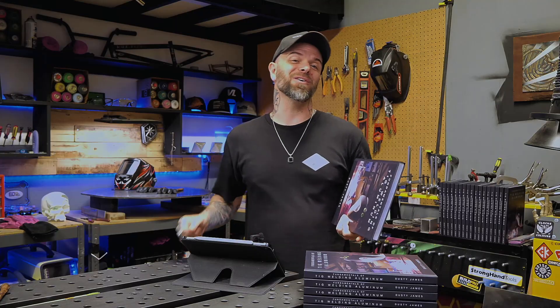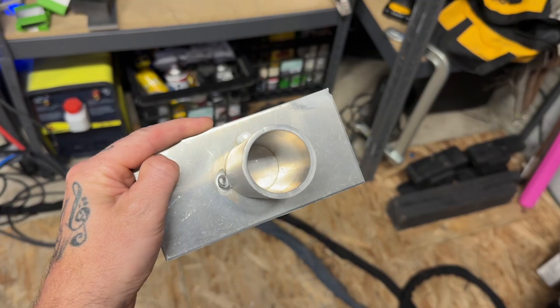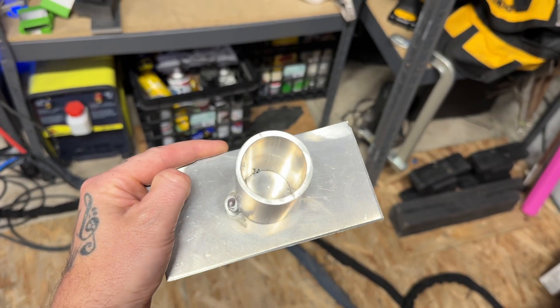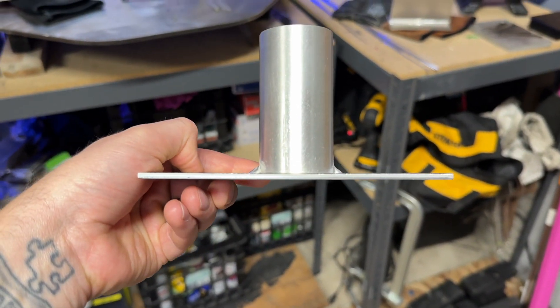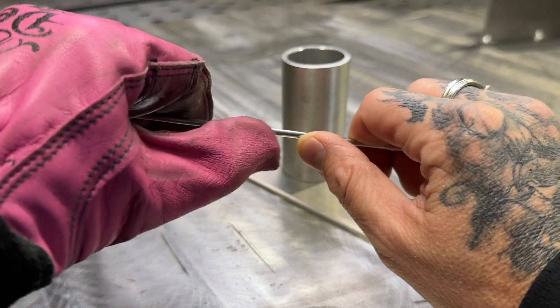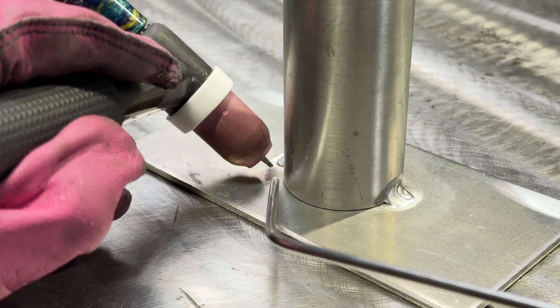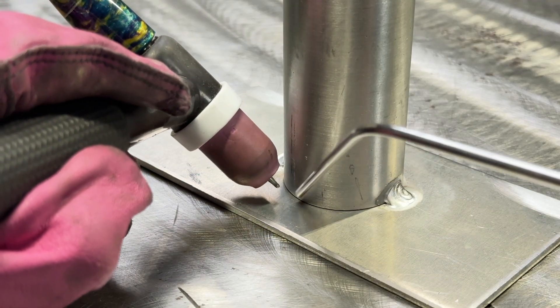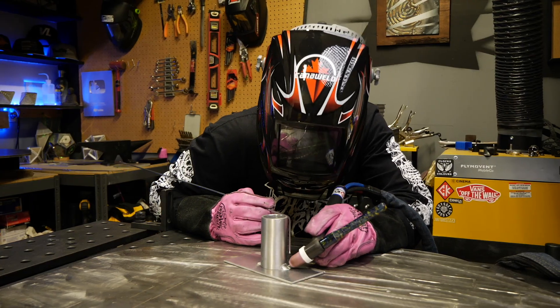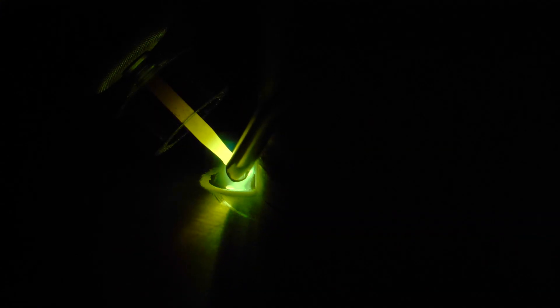Let's go even further. This one is one of my favorite exercises to teach my advanced students. You can see we are set up to weld around the diameter of this pipe, so the fillet joint is going to have to go around a circular object instead of a straight line. Between the two materials there is also a mismatch in thickness — the pipe is a little thicker than the plate. This is what makes this exercise much more interesting and very challenging. When you're welding this exercise, bend your filler material — it's going to help you get your hand out of the way so you can see much more clearly and maintain the correct filler material angle. Run the first half exactly as you normally would. The traditional underhand grip is definitely challenged a lot with this exercise and it's a great way to take your fillet joint welding to the next level.